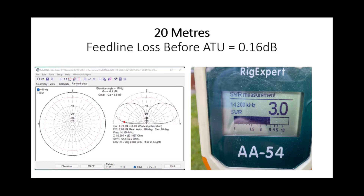Looking at 20 metres first. On the left-hand side we've got the far-field plot — decent gain, with minus 6.1 dB at 5 degrees off the horizon, pretty typical for a quarter-wave ground-mounted vertical. On the right you can see at the feed point we've got an SWR of 3-to-1 — the 9-to-1 unun has transformed that down to 3-to-1. With 7 metres of Hyperflex 10, that gives us a feed line loss before the ATU of just 0.16 dB. Very, very manageable.